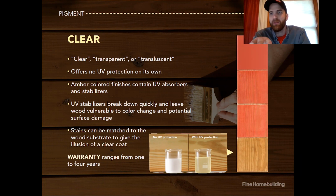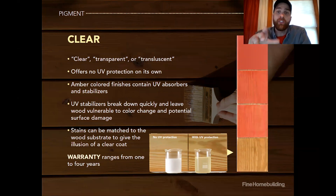It's a little more complicated with a deck board because of those fasteners holding it, and what's going on between the fasteners versus outside of the fasteners. But the effect is the same. The thing that's important is not whether the deck boards are bark side up or bark side down. What you want is good airflow below the deck.